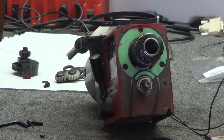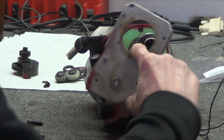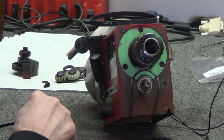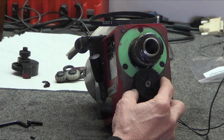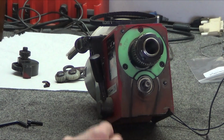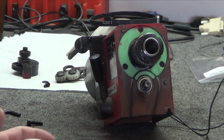There, I just had to shoot this. I thought you had to take the whole head off to get the belt out, but no, it's all greasy, you just have to remove the cap here and you can get it. But I'm looking at it going, wow. There's a keyway, little teeny guy that goes right in here. And when I got the belt off, this gear was moving a ton. And I thought, oh great, another gear. Nope, it's the keyway got worn out. There's a big groove in it from hitting the sides. So I got to figure out how to make a keyway.